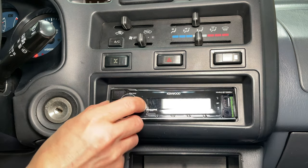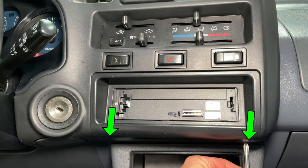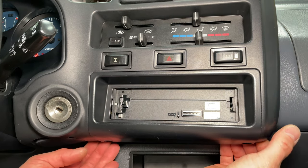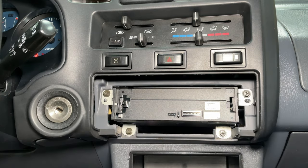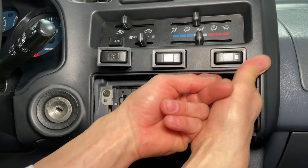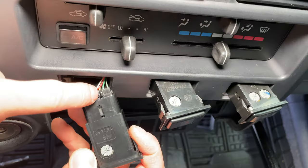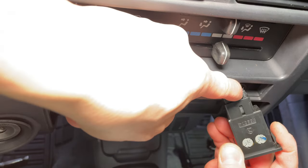Remove the radio face plate first. Take out two Phillips head screws under the radio trim bezel. Loosen the plastic dash trim by pulling it toward you, then the radio trim will go straight down. Put your fingers behind the center locking differential, hazard, and defroster switches to push them out. Unplug the three switches and set them down in the same order on the passenger side floor mat.